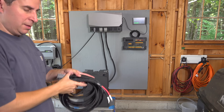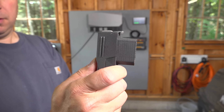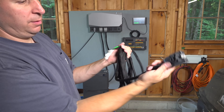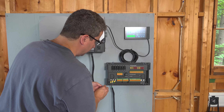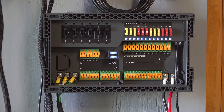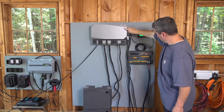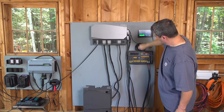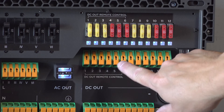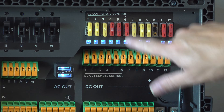At this point our system is powered up, the batteries are getting charged from the sun, and we're ready to go. Now we're going to connect cables to the distribution panel — one cable for AC and the other for DC — and that single panel allows you to connect both kinds of circuits. With the connections made to the panel, I just plug the opposite end of the cables directly into the power hub. Now the lights are already on the distribution panel. Unlike dumb panels with no electronics, this one has a communication port, and once we plug that into the smart hub, we've got everything talking — you can see how much power is being used by individual circuits and even turn them on and off.